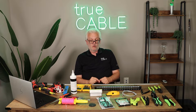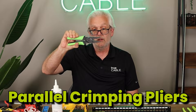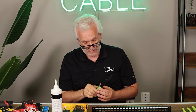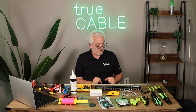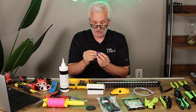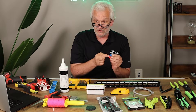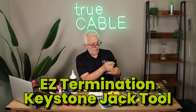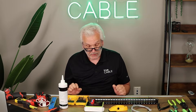If you're using keystone jacks, you'll want parallel crimp pliers — these apply force in parallel so the terminal end isn't malformed during termination. For keystone jacks that are punched down, a punch-down tool is essential. It gets old quickly punching in all eight individual conductors one at a time; this tool lets you lace each conductor into the slot and punch them all down at once, cutting off the extra wire — a big time saver.